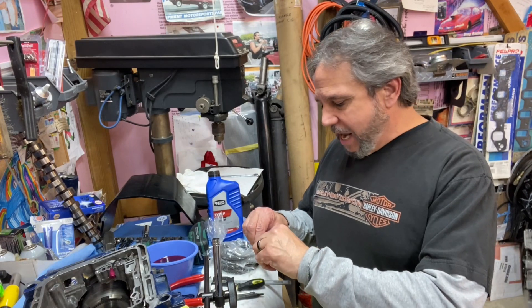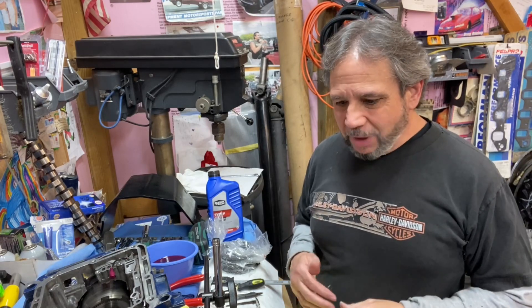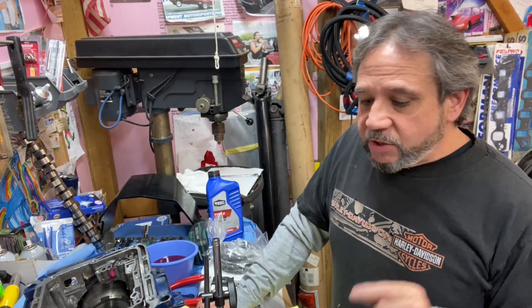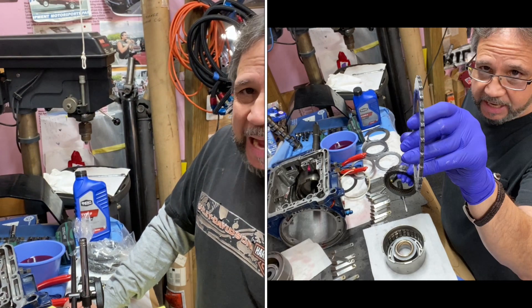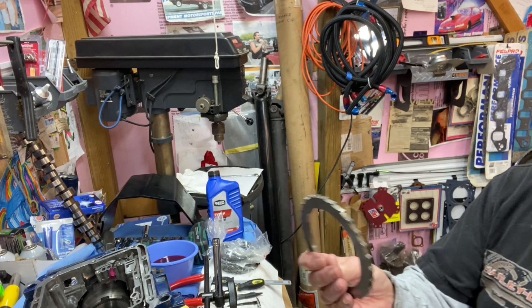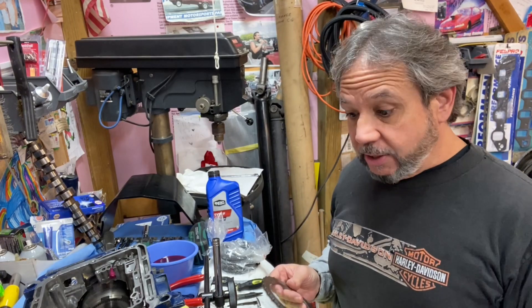I'll kind of let you know where I'm at. You have seen me do the sub-assemblies. One thing I will say — I talked to Paul Atomatis, and he told me when he watched the video that I had put the pressure plate in the wrong spot, and that it needs to be at the top. The thicker pressure plate needed to be at the top. I only had it against the piston, so I had to change that.